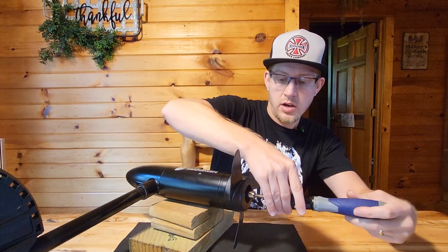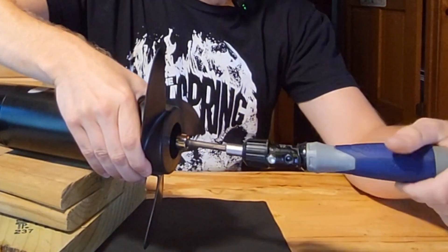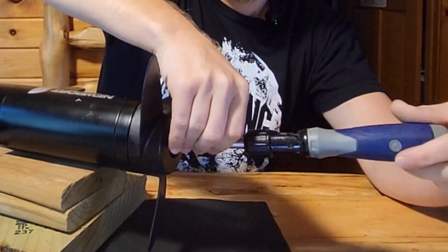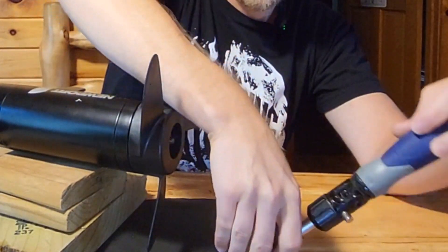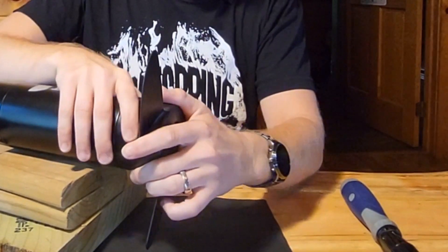First, we're going to take the nut off — it's a 13 millimeter nut. Mine did come with its own tool, but I've got my own tools; it's faster and better that way. So the shear pin: if your prop gets bound up by weeds or hits a rock or something, instead of breaking your prop or your lower unit, the shear pin is supposed to bend or break, and that saves you a lot of money based off of just a tiny little thing.